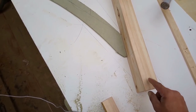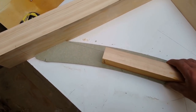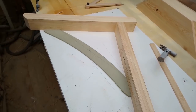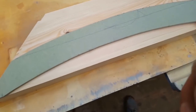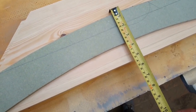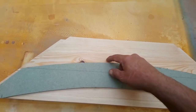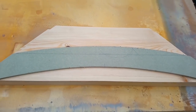So put 45 on this end, got enough room to get a bolt in, but then I should have that line, best part of 2 inch running through there, that's working as a brace. So I'll sand that up, screw it to them. Alright, now I need to cut this out. I don't have a bandsaw, so I'm going to use my router for this template. I could have got away with 6-inch timber, but I prefer to have too much. I'm going to rip this down a bit, cut some off, and then carefully cut this out with the router.